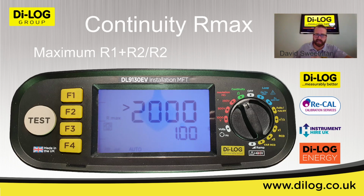If it's a radial circuit, you would do exactly the same again, but testing at light fittings or light switches, and you can go furthest away and find the furthest point. Generally speaking, if you've done the installation, you'll know where that is anyway, but it's good to know what the maximum is. And if you're anything like me, when you do a test and get a particular reading and then do the next test, you've already forgotten what the result was from the previous one as well. So this is a very, very useful feature for people with memory like myself.